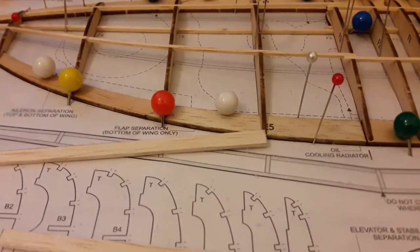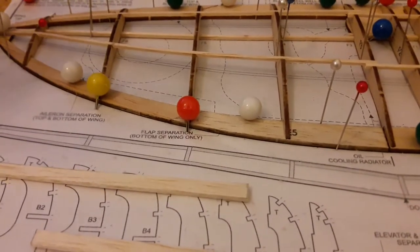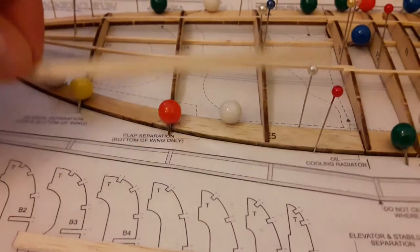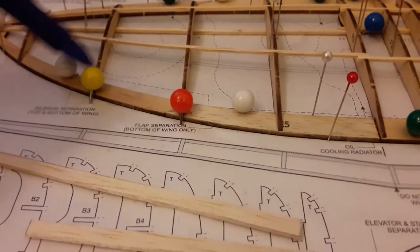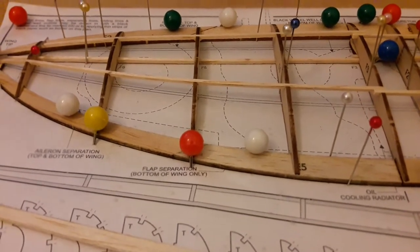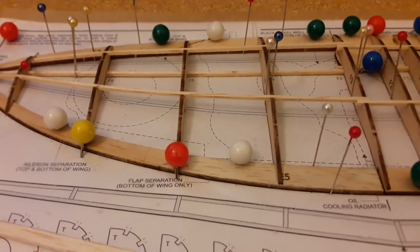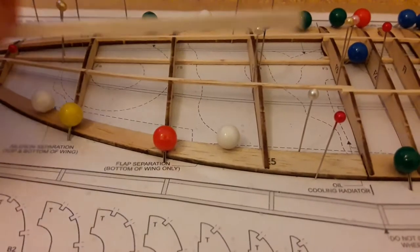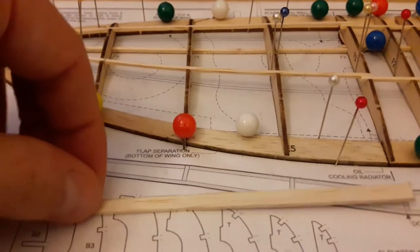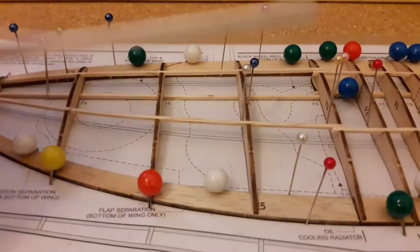Another big problem will be how to move the ailerons, but that will be covered in a future chapter. For now, I'm going to go aileron by aileron — I'll cut the middle ribs at the size where I want to put in the new spar, and then build two new ribs, one for each end, the same on both sides. It's a nice challenge with a lot of detail work. As carpenters say, measure twice, cut once. If I did cut it wrong, it's not a big deal — mistakes can be fixed relatively easily at this point. Let's go and see how it comes along.